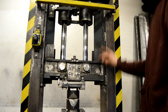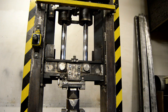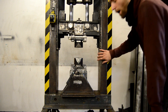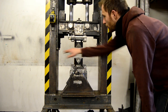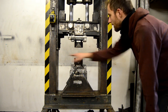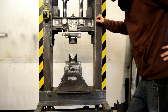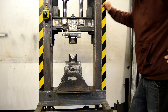I made the ram so tall to keep it from twisting within the frame, which is especially important when you have two pistons instead of one. I wanted the press to be as small as possible but with the biggest possible operating space, so this is about 50 centimeters across — about 19 inches — and the ram travels up and down about 30 centimeters, which is about 12 inches.